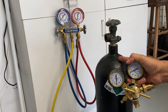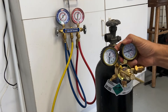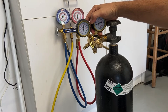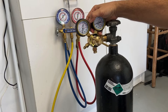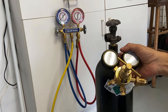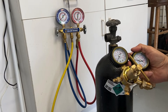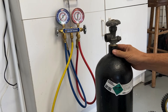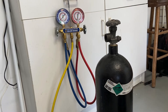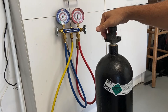I've always tried to teach technicians to keep the regulator and tank separate. Some guys will install the nitrogen gauges and leave them connected on their truck, and eventually the regulator goes bad as soon as the bottle falls over and bangs around a service truck for a couple of years. I typically ask guys to take the nitrogen regulators off, put them in a box, put them on their shelf, and securely store the nitrogen bottle in their truck.